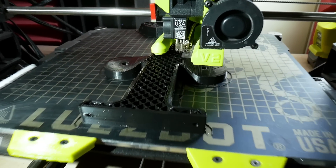We need a piece in the middle with another servo which is going to turn those two big gears — it's just one servo because I need the additional eighth servo for the head. Here is that mechanism assembled — you'll notice one of those big orange gears is shorter than the other so the servo gear only binds on the taller one. So there's the whole assembly together: you can see those gears turning the legs vertically and also those other gears turning the whole thing sideways with one servo in each side, so we've currently got seven servos in there. Now we need to place the head servo, but first I'm going to put some body panels on because everything is supported like a box structure, so let's screw those on.